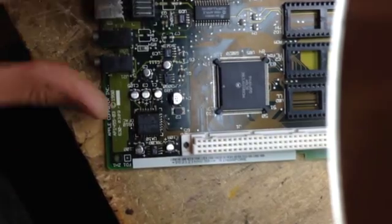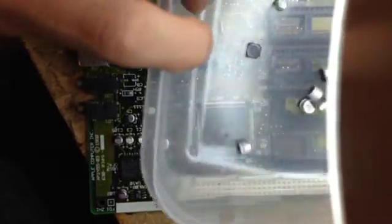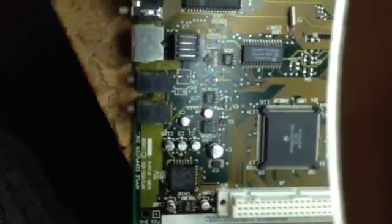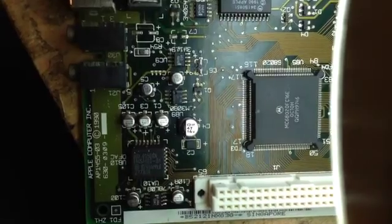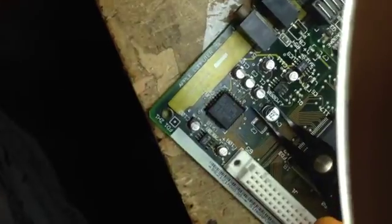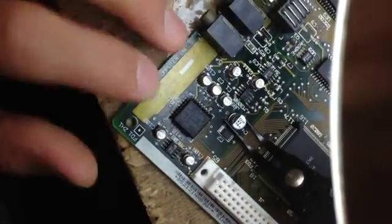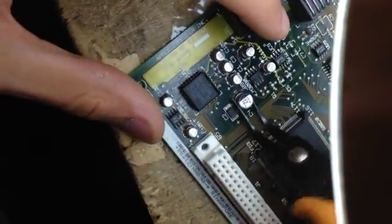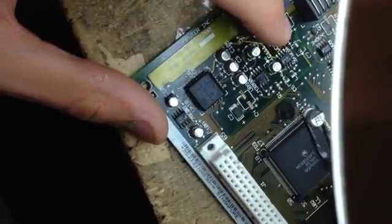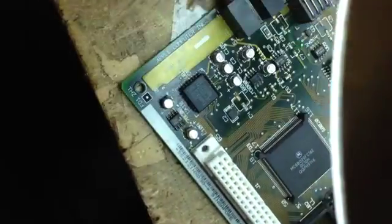So I've just started removing the capacitors. I'm going to show you how I do it. We're nice and focused in - just pick on my pliers, start wiggling it, and voila. Nice and clean, and I didn't lift the pad.